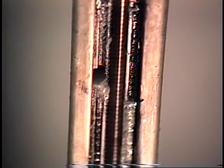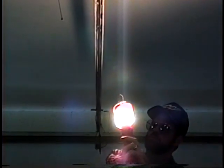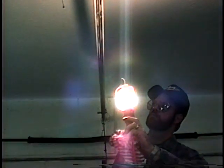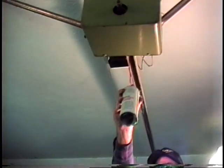Okay, now Ron, you hold the light. I'm going to put the door up about 3 feet, and you'll actually see the worm gear start to work, and you'll see it turn that grease and go up and lubricate the whole area. You can see the worm gear, I think, turn. You see it all right? Yeah. See, that took it right back up in real nice, didn't it? Yep. I didn't bring it all the way up to the stop switch. So let's go on out to the end, and then we'll have this one lubricated all the way.